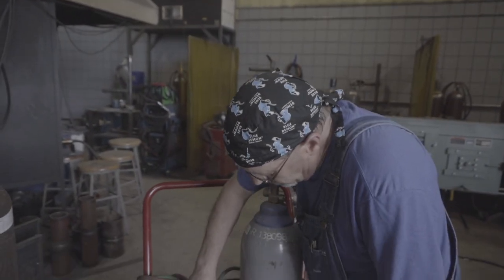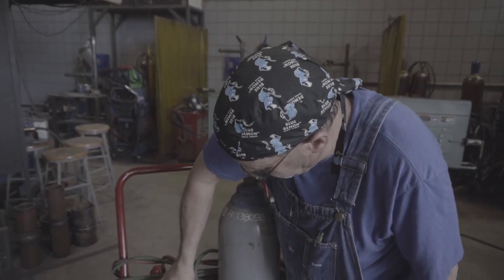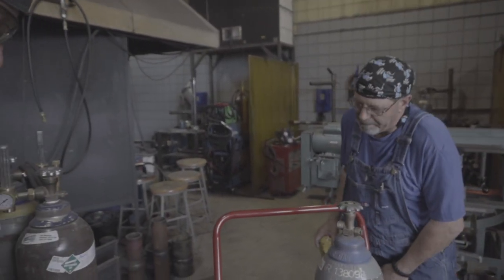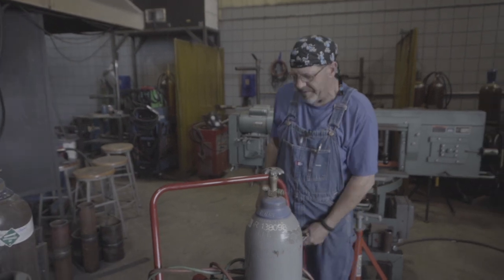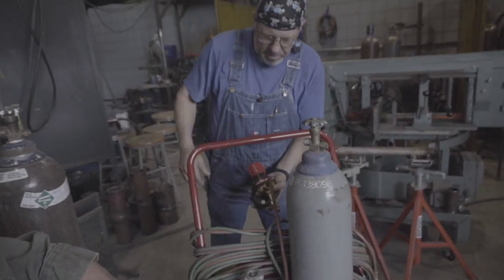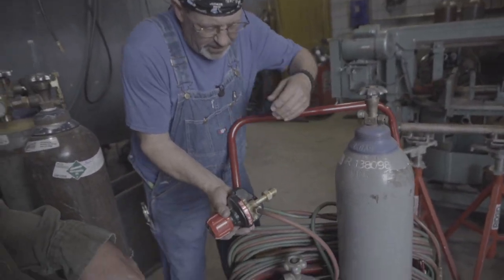Pure oxygen and any hydrocarbon is not a cool thing. No oil — it is violent and complete combustion. Does it matter which one we put on here first? No, it doesn't. So we'll go with the acetylene regulator.